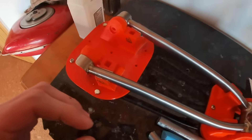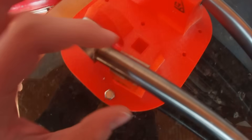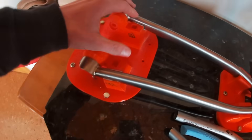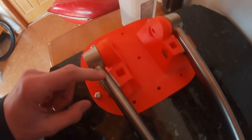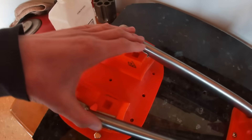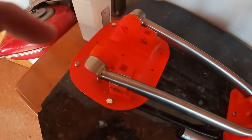I do also want to mention that this project has by no means been perfect. You can see right here, we've actually put some bondo — pretty janky, but we put some bondo here. Because we made a mistake on our calculations, it was difficult to CAD up these stays since they have really strange geometry. We ended up having to move them out from our original design, and you can still see it's pretty close to the edge — the weld actually creeps right up to the inside surface. In the end it did work, but if we do this again, I would like to not do that.